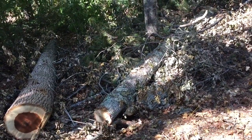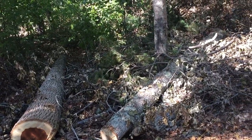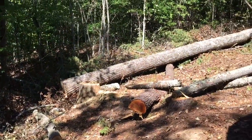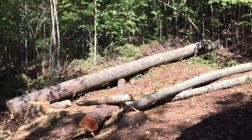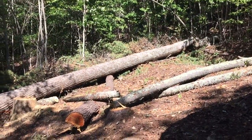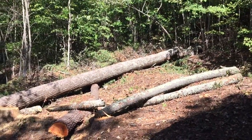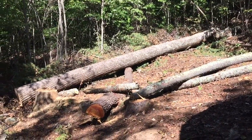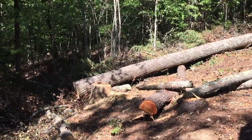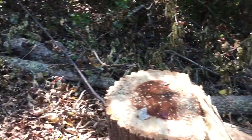So there is something for the ground person to be doing. Use the peavey as well to make sure you are not digging into the dirt with the saw. A wedge also helps — I'd suggest looking up wedge techniques to lift the log off the ground if you haven't already; that's a really good trick. Make sure the cuts are completely severed — not 90% of the way through — that really causes problems for somebody trying to use the logs. Thanks guys, see you soon.